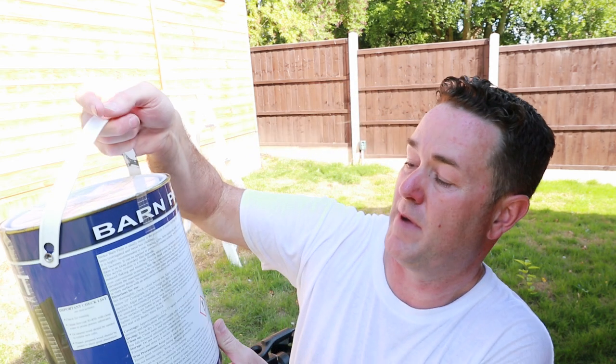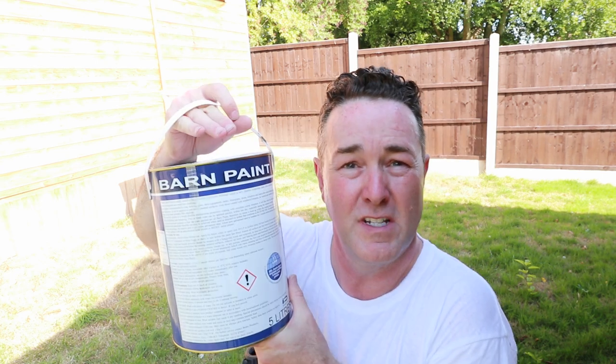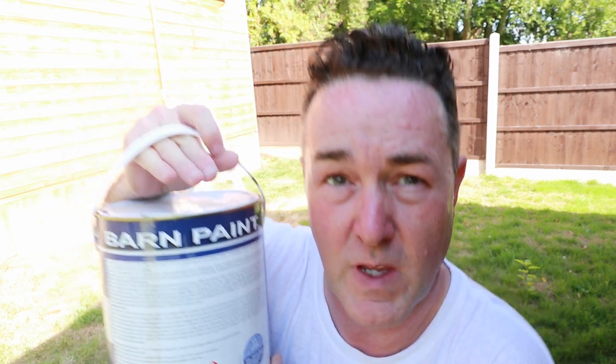Read your mix ratios. When you're doing first coats of paint, just thin it down. When it's going on to bare wood you can go 20 to 25 to 30 percent. It says on the back for porous surfaces — and a bare shed is quite porous — 30 to 40 percent. So you can really add quite a bit of water to it, then build up to be thicker.